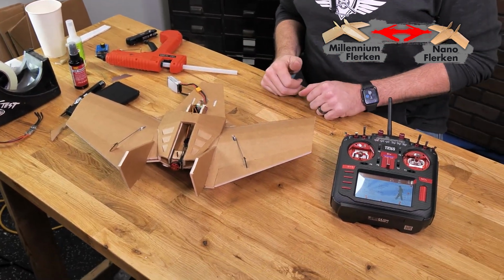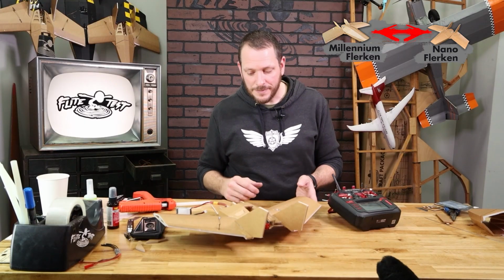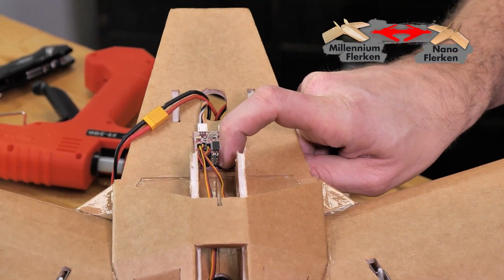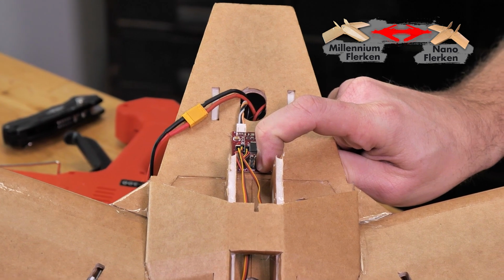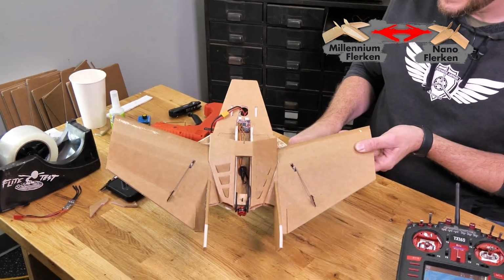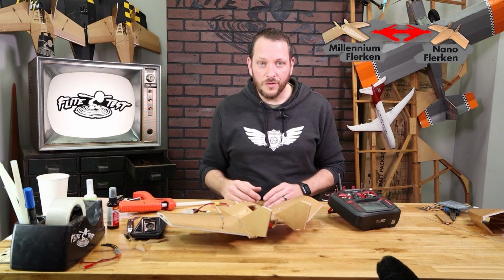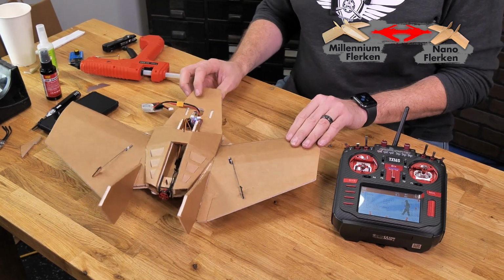We've done all the changes we need to do now on our controller and also on the plane. We're ready to exit out of quick set mode, and to exit out of quick set mode, we're simply going to hold down on the bind and the trim button once again until we see the status lights change. So here I'm holding on bind and trim together. 1, 2, 3, 4, 5. I'll release. Rapid blue light means it's rebooting. Perfect. Just like any time we've done lots of different changes to the control board, let's do one more power cycle. And we'll plug this back in.